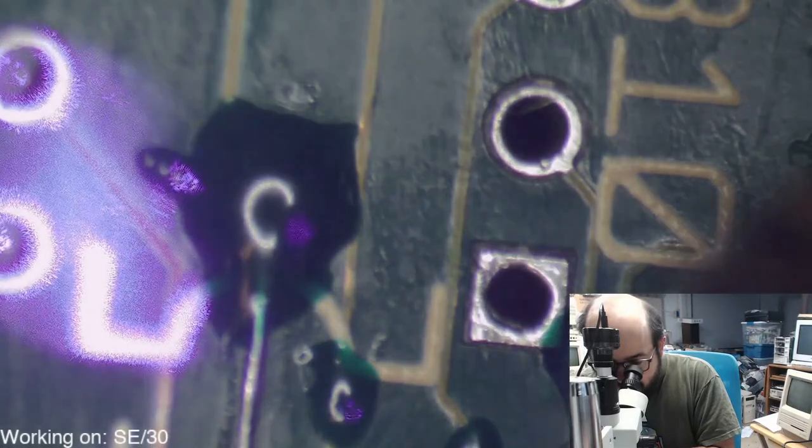So what I am doing is, when I scraped away something that has been exposed, if that bare copper is exposed, it could corrode in the future. So to prevent that, sometimes you could just splash it with solder. But what I'm doing here is I covered that solder with the UV solder mask just to add some extra protection. And also in some areas where I do not want that solder or that copper accidentally touching something, if I'm going to be soldering something next to it, I want to coat that so nothing can touch it.